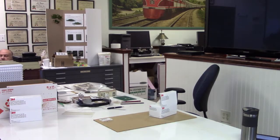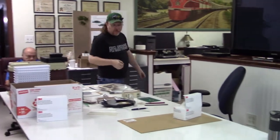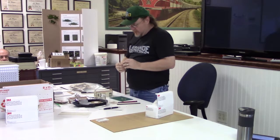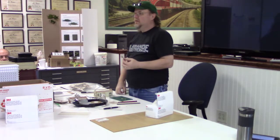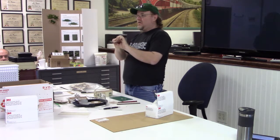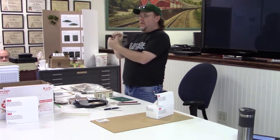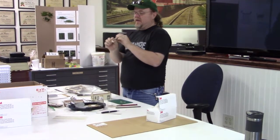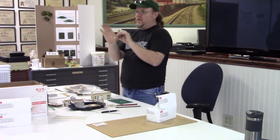All right, for some reason, some of the guys have overhang and some of them don't. I'm not real sure how that happens considering it was all cut with the exact same drawings. Now see, I don't have any overhang on mine at all. That's really weird. Okay, some of the guys are finding that desk piece, by the time you glue it up, overhangs when you get ready to put this next one on there just a little bit. If that's the case, you're going to need to sand that bevel back just a little bit till you can flush it up.